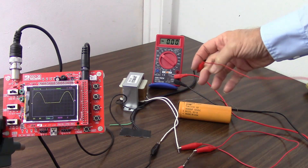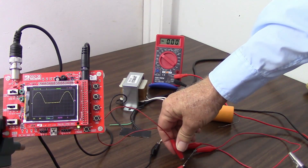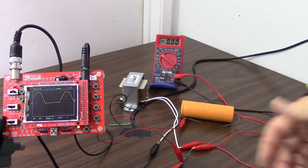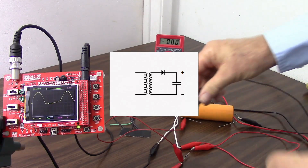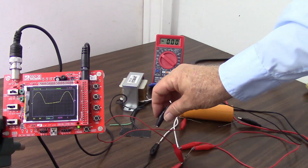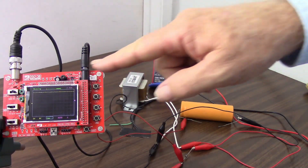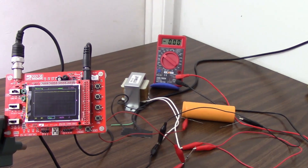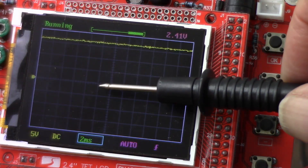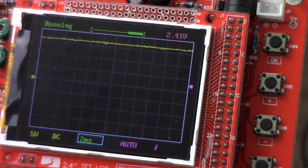Notice the plus marks over here, so I want to put the positive side here — I'll put the red clip lead there for positive. Hook that up to the positive side, the cathode of the diode, and I will take the black lead and hook it up over to the negative side. Now watch what the oscilloscope does when I hook this up. And we see that goes right up to about 16 volts — it goes right up to the peak voltage. So you can see there's our 15 volts: 0, 5, 10, 15, and there's just about 16 volts up there. That charged up to the peak voltage and it's just sitting there. So now we have 16 volts DC.